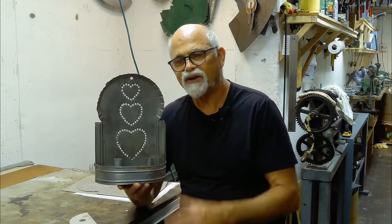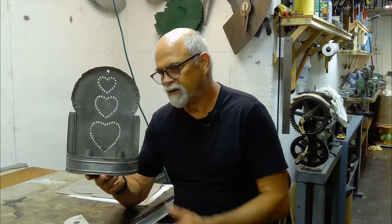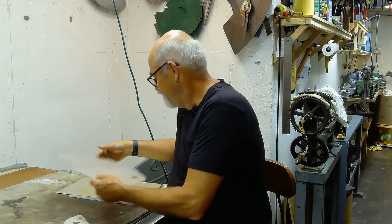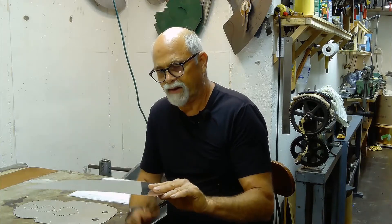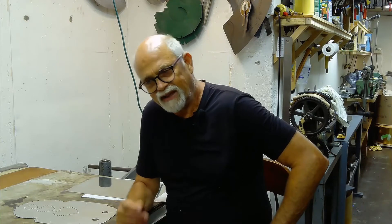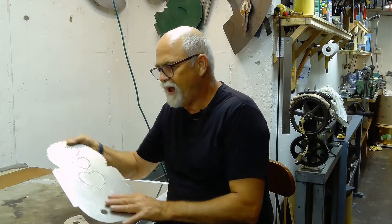The old one was made out of terne tin, and the one I'm going to make is going to be out of tin plate, which is steel covered with tin. The tin I'll be using is basically dipped tin — the advantage of dip tin is you get a nice heavy coating. The other type is plated tin, which is what you see on a tin can. There are different levels of plating, and they can get so thin that if you leave a tin can out for a couple of days it will actually start to rust.